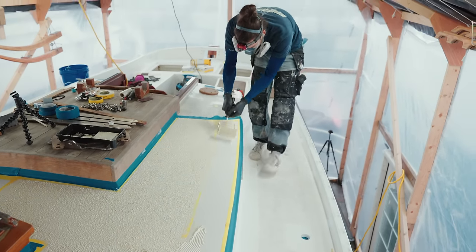All right, it's a bit windy today now, but I'm really, really happy with the fact that we've gotten so many things done here, and the exterior of the boat is quite rapidly at this point starting to be a proper exterior. Yeah, I'm really pleased. So the barrier coat on the bottom now has 3 coats on it. We may do some more, but we did exhaust our supplies at the moment because we ended up needing a little bit more than we had anticipated originally to do one coat. So anyway, that's that. But the Kiwi Grip, we're really, really happy with. I think it looks really good. And for a brand new product, you're always a little nervous with how it's going to go. And I think it went really, really well.